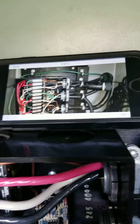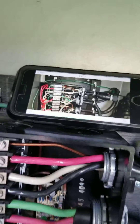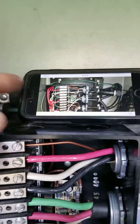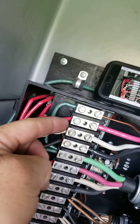When you wire in your new six gauge cable going out to the panel, the old one was wired in the neutral to that wire nut. So you'll have to undo that and take this neutral wire and add it into here.